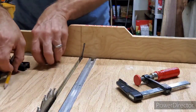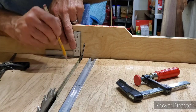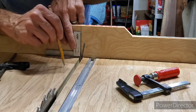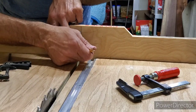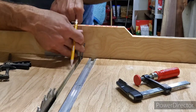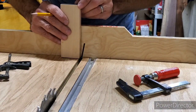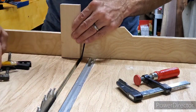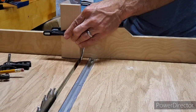What I've done now is I've drawn a straight line 90 degrees to the sled, and it's the outside of the kerf of the blade. Then we're just going to put a stop there so that all of your cuts will be exactly the same and repeatable.